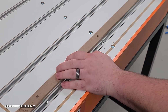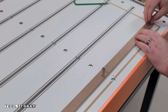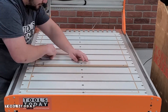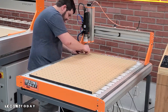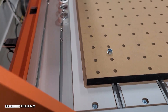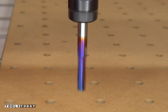So this is the use of the jig — we got everything aligned to the left side and then we can get the bolts all installed to ensure that the nuts are all in the proper location. It makes aligning these really easy. I went through and did that for all of the areas that we are going to add the bolts through the top of the wasteboard to hold everything down. I got everything all tightened down and you can see how it aligns with the profile on the outside, which will make removing it easier if you ever need to.